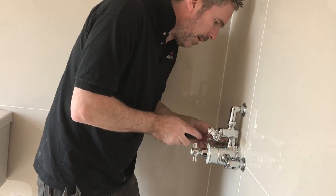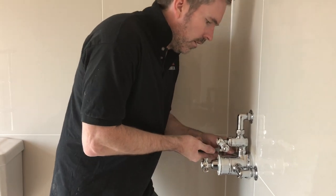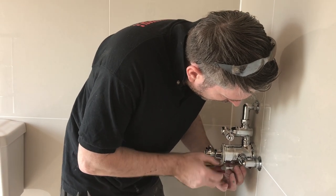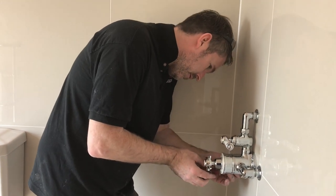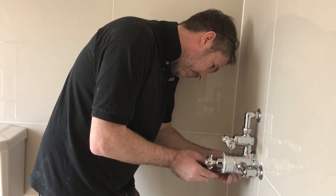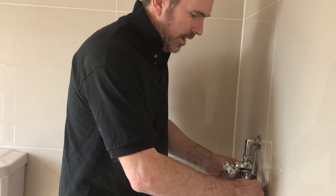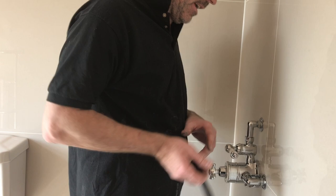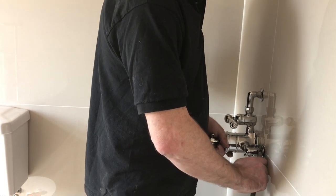That's it, pull that gap up nice. Pull that up nice. Beautiful. Now we know it's equal then, you can't get your nail in it. Pulled it up, yeah? Then go ahead and tighten your bolts, because now we know that the shower's at the right point.